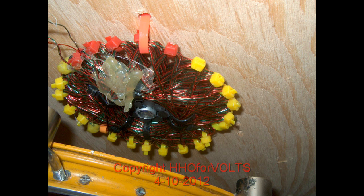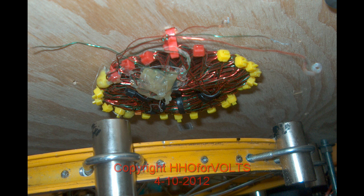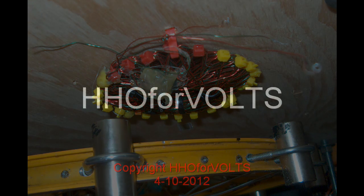Now we come up to where you can see kind of the spacing. It is critical how far through you push it, because then you'll get a cogging effect. You can see how it works by just gently spinning the wheel — it will slow down, and suddenly the magnet will speed up and just slightly show down. We pick up quite a few RPMs and our current drops.